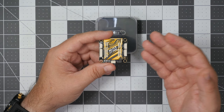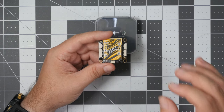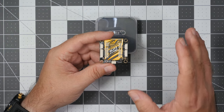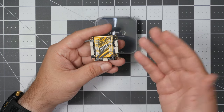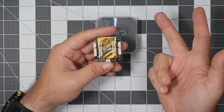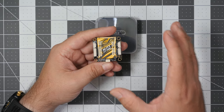The extra shielding helps to achieve that — not by much, and personally I think it's an overkill, but it's a nice touch that differentiates this flight controller from every single other one on the market. Besides the shielding, and the fact that this is fully plug-and-play with no soldering required, it's a pretty standard F7 board: 8 motor outputs, barometer, four serial ports, integrated OSD, I2C, and 512 megabits of flash memory on board.